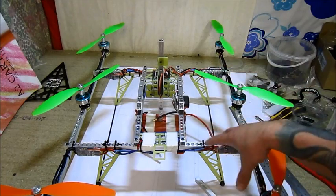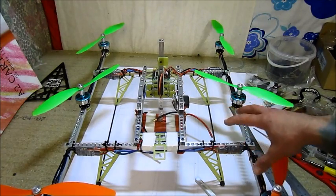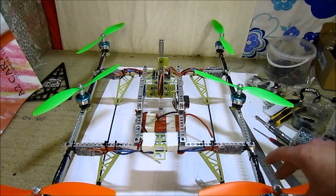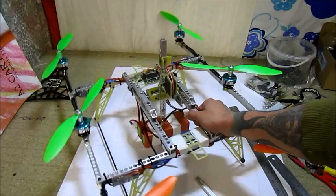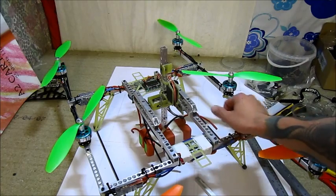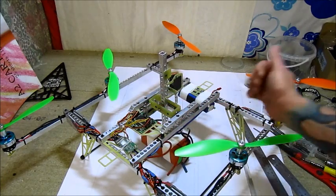The all-up flying weight including the dead weight is 2.45 kilos, so all-up flying weight will be around two and a half kilos with the GoPro on. If I want to add FPV it will add a little more, but on 2.5 kilos it should be good to run on four cells. I've tested these motors on other copters — a hexacopter at two and a half kilos on three cells with 12-inch props flew well — so the weight-to-power ratio should be good. I've just stuck the gimbal on with tape quickly for testing, and it sits on rubber dampers, as does the KK2 board.